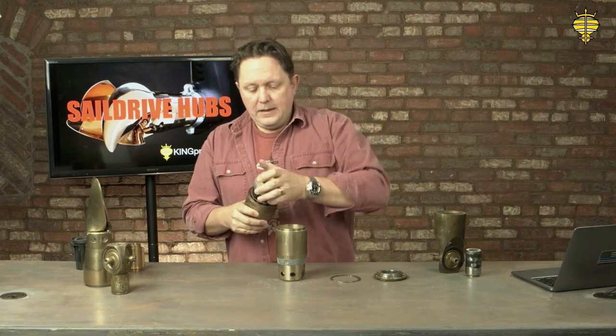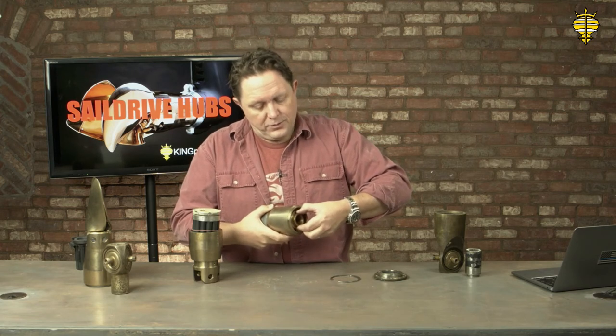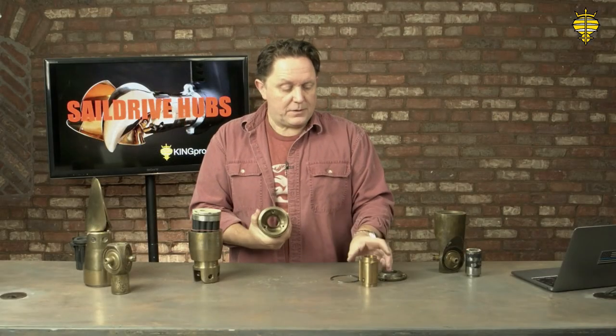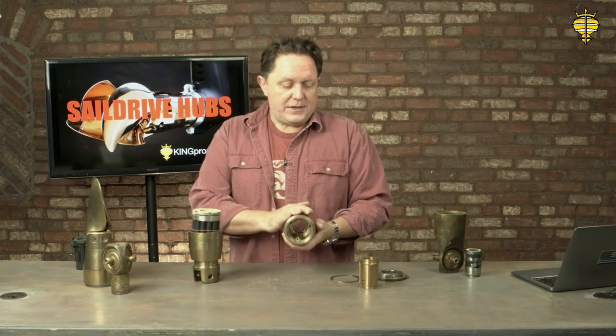One of the things you should do when you're on the hard — grab hold of the prop when it's in gear and it shouldn't move. If there's no rubber system inside, it'll move and you'll also get some rotation. So when you're on the hard, if you can physically move it or it feels like the nut is loose, then it's time to have a look at the dowels. I'd strongly encourage you to get in touch and get a quote on replacement — it's a very straightforward process, takes about 20 minutes and it's not expensive. You can just send in the hub, we can replace the interiors and get it serviced.